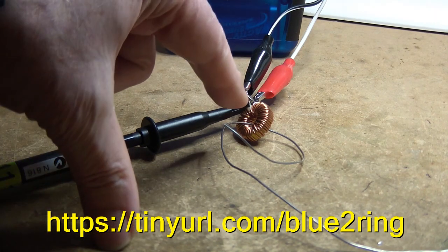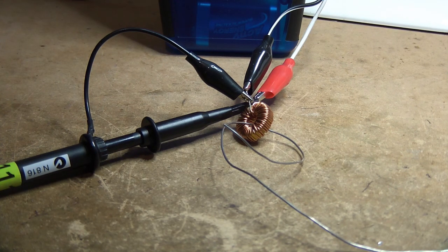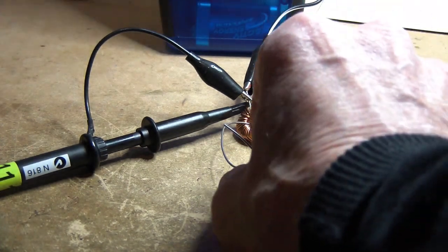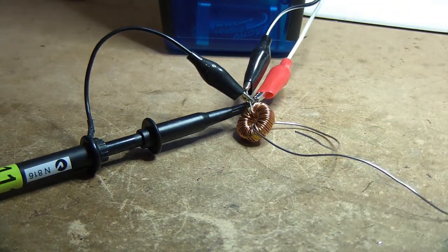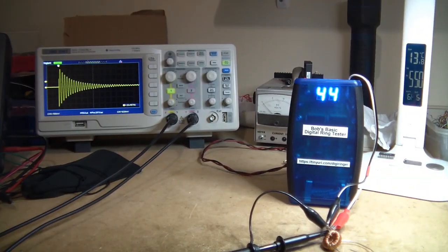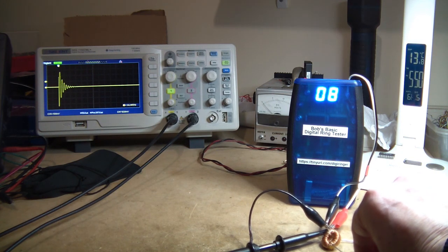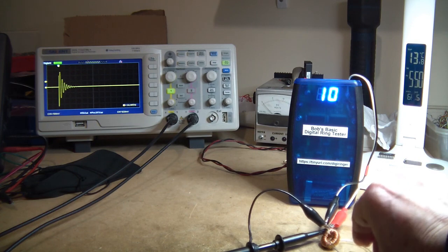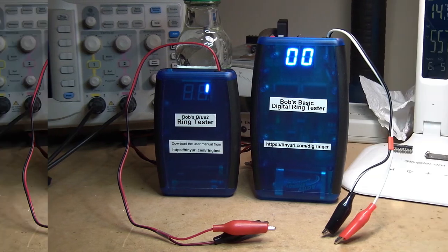What we have here is an iron powder 100 microhenry power inductor, and I've got a bit of solder looped through it which can demonstrate a shorted turn. Now, turning our attention to what the ring tester and the oscilloscope are actually showing — have a look at what happens when you short the shorted turn: it drops dramatically and there are just a few rings. That is how you can pick a faulty inductor.